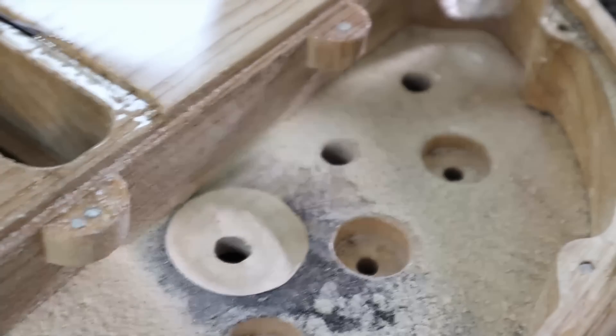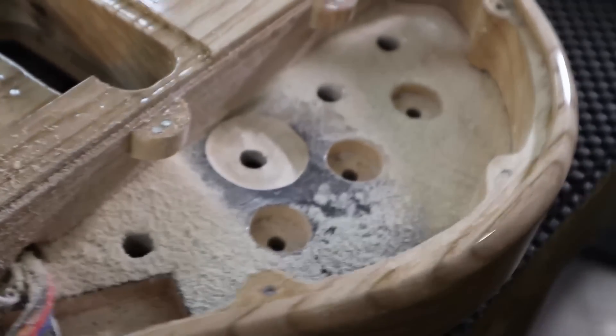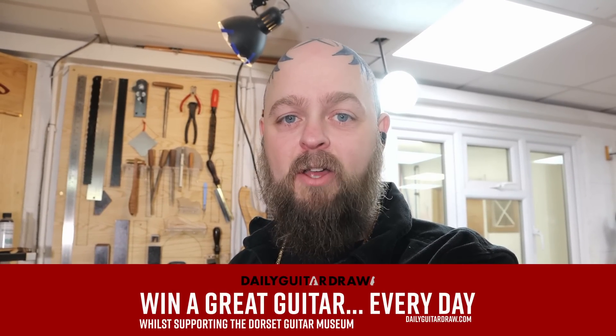I take it back — it actually kicks out quite a lot of finer dust, so this is going to be moving over to the sanding room and dust masks. But you can see just how perfect you can get with something as simple as a multi-tool and a little carving burr. I've got absolute control, I can see exactly what I'm doing, and I can fit it to the guitar. Most importantly, when your customer opens up the back of their hopefully multi-thousand pound guitar that they've just commissioned from you, it looks like everything went as planned — it looks attractive, nice and smooth, not a jagged nasty crunchy mess from where you've had to go in with a Forstner bit. Please click like, subscribe, share this video. Check out crimsonguitars.com — daily guitar draw, all that jazz. Go make sawdust, see you soon. Goodbye — Crimson Custom Guitars, why? Because we're awesome.